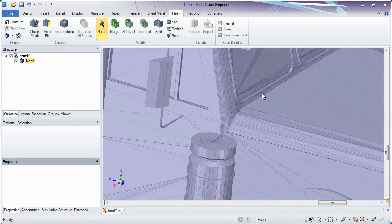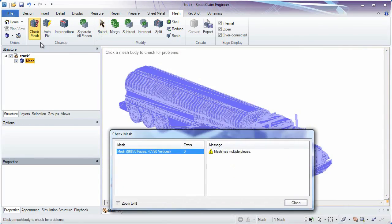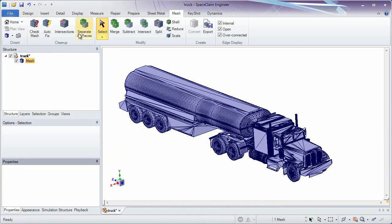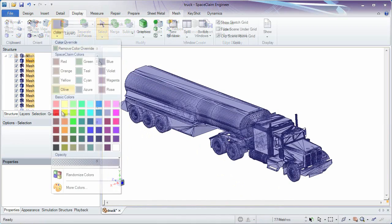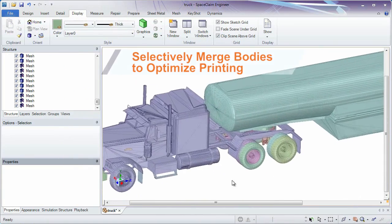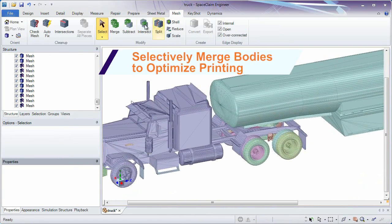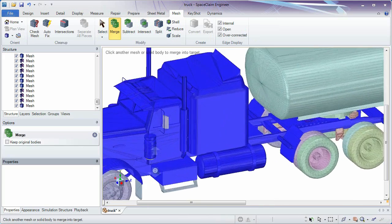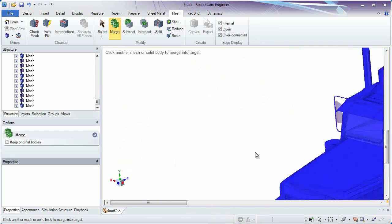All misaligned facets are properly joined together with an intersection tool, and residual openings and inverted normals are corrected and closed to form a watertight STL. The tool will also tell you that multiple bodies exist and let you split them all up — especially useful when printing bodies separately for texture, color, or material requirements. Easily join bodies together or keep them separate if desired.